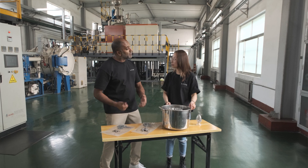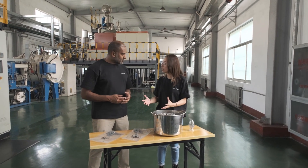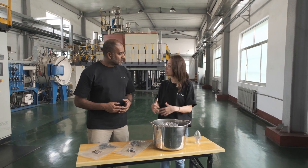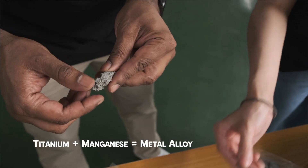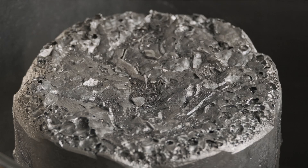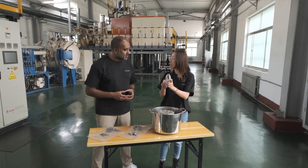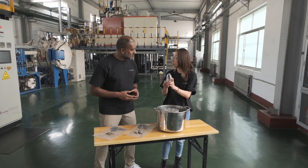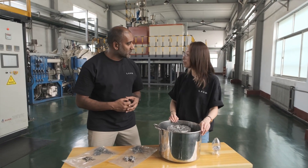Sherry, I'm so excited — I feel like I'm back in science class. Can you explain to me the first step of the process? So the first step is we're going to prepare the raw material, which is going to go in as one of the recipes for our metal alloy. What you can see here is titanium and manganese, and when it's made into a big ingot, we're going to chip it out into small pieces. All the small pieces will look like this, and this is the metal alloy we're going to fill into our vessel, which is going to become a battery for the hydrogen system. I can't wait to have a look at how this process actually works. Can you show me? Definitely, let's go and check it out.